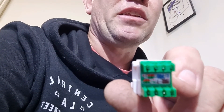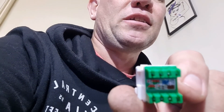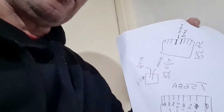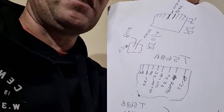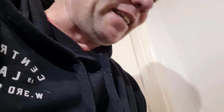Up the top, from one on the left to four on the right, we're going to use three and four to connect this up. The standard for this — I think it's Scott's Guide, it might not be, but I'll list it in the bottom there. And I'm sorry about the reverse writing — it's a T568A, which is the standard that we're going to be using, and it uses the center two pins on this to go to your modem.